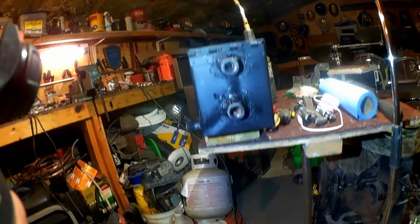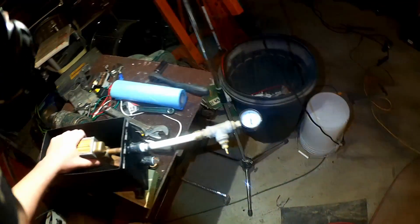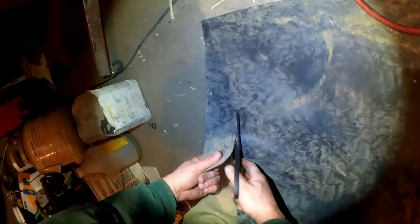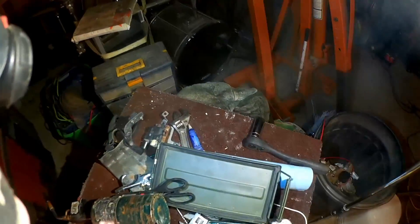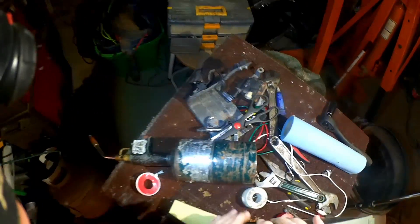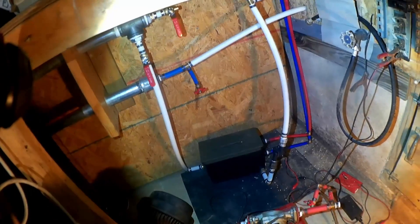And nothing's melted off. Followed by another pressure test. It's sealed. Then I install some foam baffles to direct the furnace water through the fins of the heater core. Then I cut some strips of rubber roofing to go on top and bottom of the heater core, to hold it tightly in the box without allowing metal-to-metal contact. Check the fit. Feels just fine.